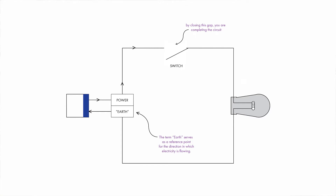The way the module works is that it allows you to control the output of your circuit by having you physically complete an internal circuit inside of the Makey Makey module. There is a miniscule amount of electricity flowing into the left arrow, right arrow, center, and earth ports on the Makey Makey module circuit board. When you touch the earth port and then touch any of the other three ports, you're essentially opening up a trap door inside the circuit that allows a larger amount of electricity to flow through and into the output snaps on this side of the Makey Makey module.